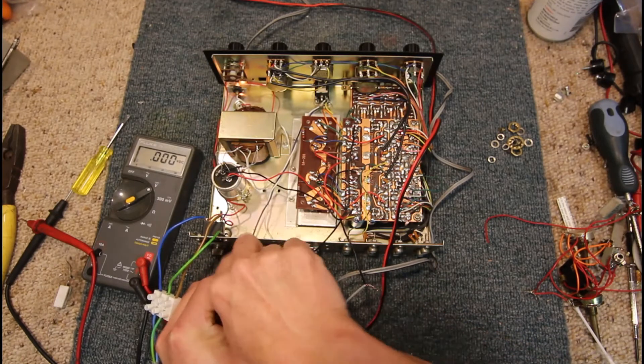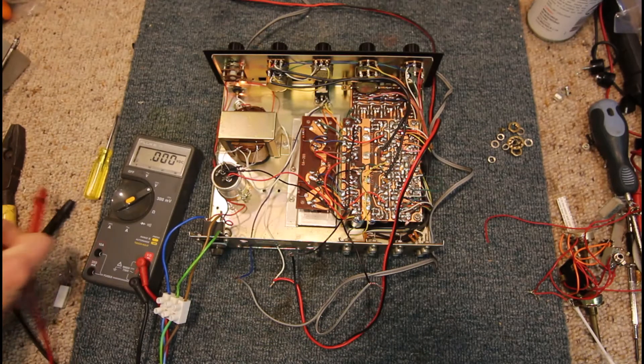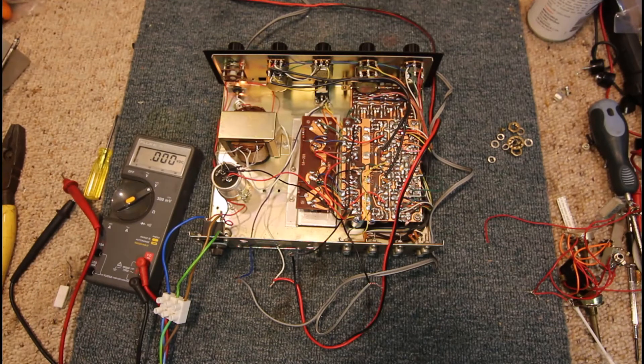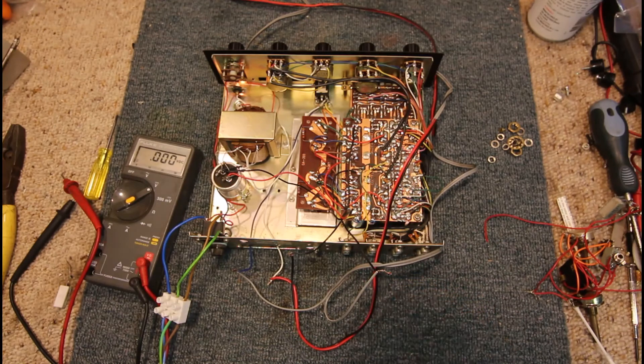You don't want these outputs touching the other channel either, so keep them away from ground, keep them away from the other channel, or you may cause some blown outputs. Like I say, because this isn't DC coupled, it probably won't matter a great deal. Now what inputs have we got here? Phono, tuner, etc. I'll see if I can get a CD player up and running.